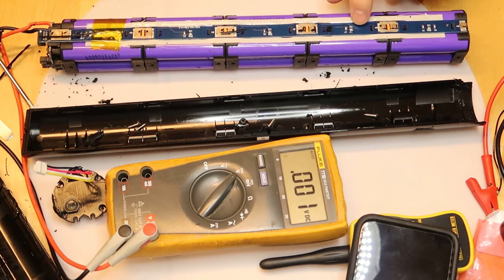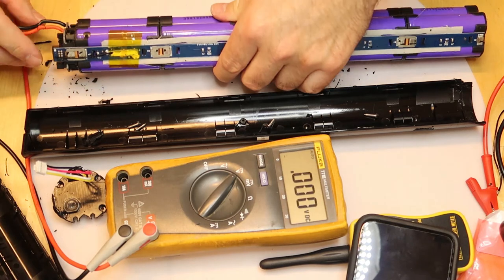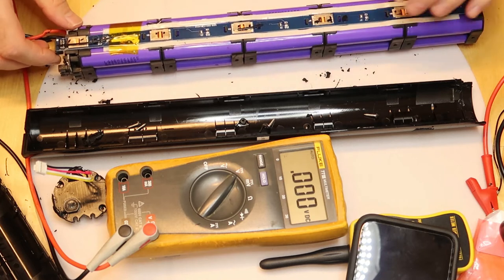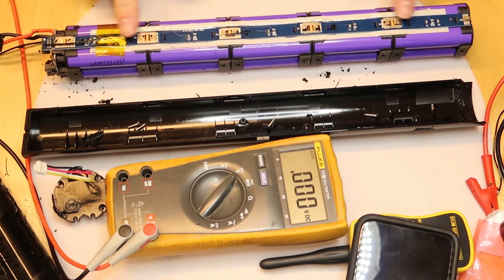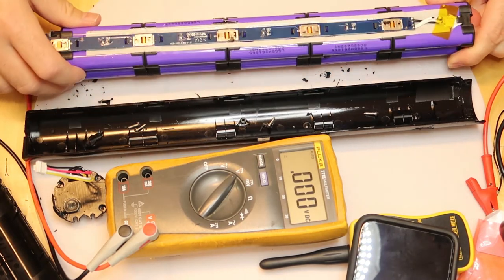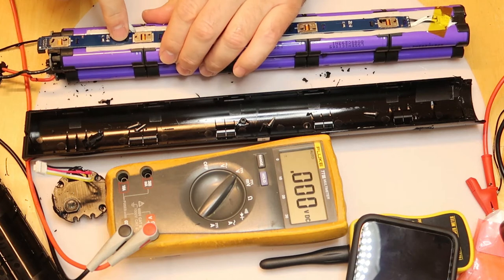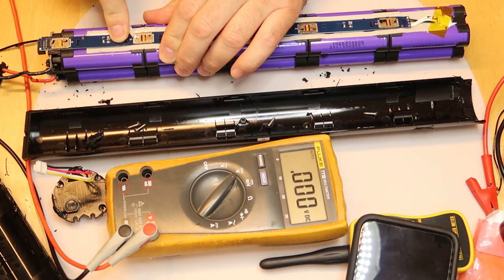Another interesting thing is that I think that this resistor is the balancing resistor, which means when you need to do a balance, if one cell is charged too much, you start to discharge it, so you have a transistor and you have the resistor that is doing the part of discharging the cell during this method. Okay, so now let's disassemble it. Very simple, you have all the PCB on this side, on the other side. What I need to do, it is not solder, it is actually done with pulse spot welding, because I can see the welding. So we'll see how easy it is to open it, if at all.